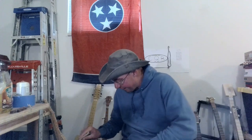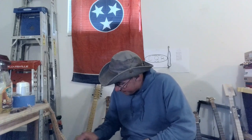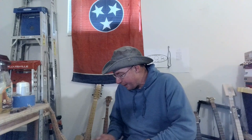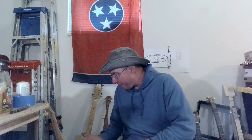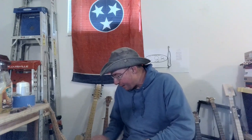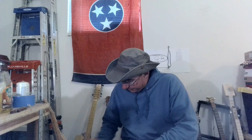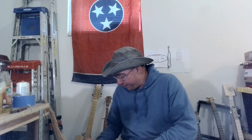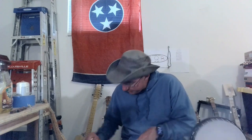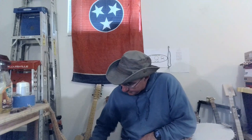I like this. The other thing this sanding does, so when I put those dowels in there and I got the flush cut saw and I sawed off the end of the dowel there, it did leave, because the blade of that saw is right up against the wood, it did actually leave some bite marks from the teeth on the saw blade.